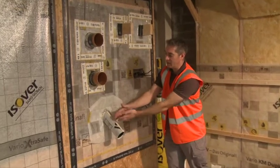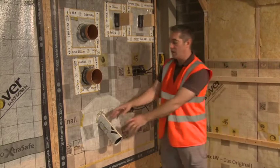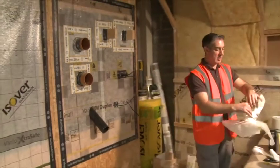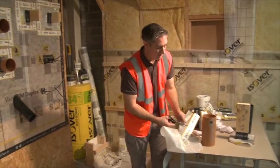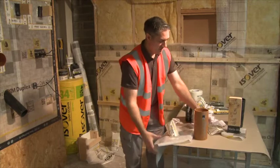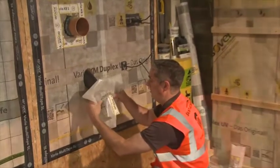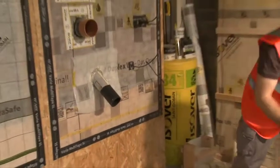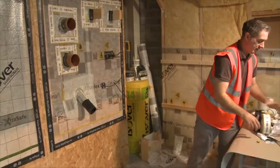When making this section up, it's easier to work with more material than fiddly little bits, so I've made this collar quite large. Once it's dry — and it's virtually dry — we can just cut it to the size we need. Remember, tapes don't go around corners, they go in straight lines. We then just need four more bits of tape, and then we've just got one cable penetration to detail fairly quickly.